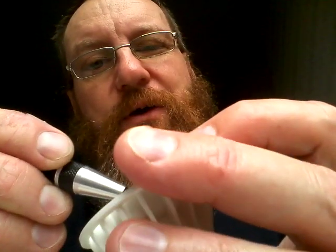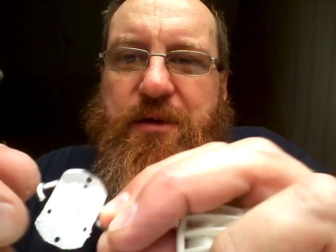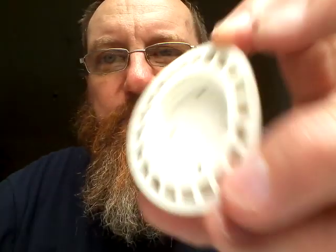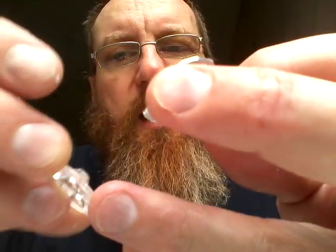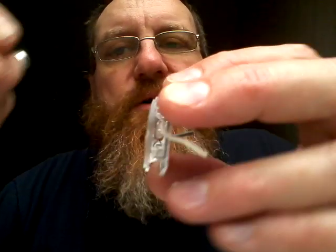Let's go back to the LED PCB now. Now that I've chopped the wires, let's see if we can hoik it out. It is aluminium at the back, as you'd expect, and it's got heatsink compound going onto the plastic, so the plastic is acting as the thermal dissipator. All very neat. I notice that the circuit board has holes on it which the heatsink compound is squished up through, and those holes also serve to align the reflector. It's a nice enough little lamp — maybe give some a wee soak test and see how well they last.